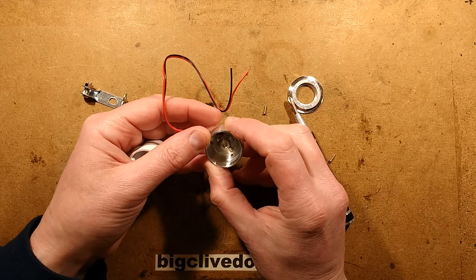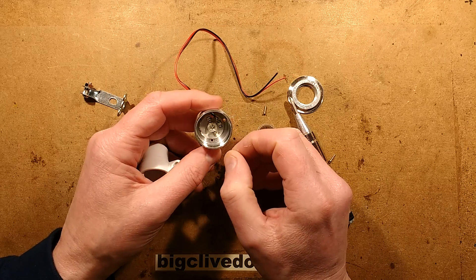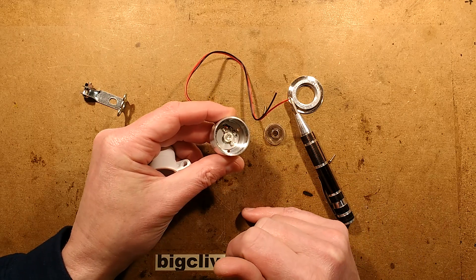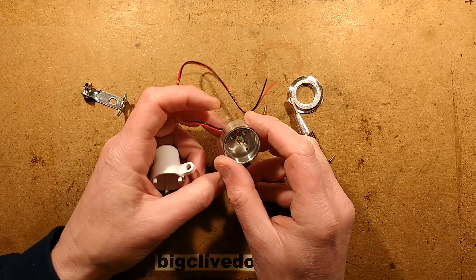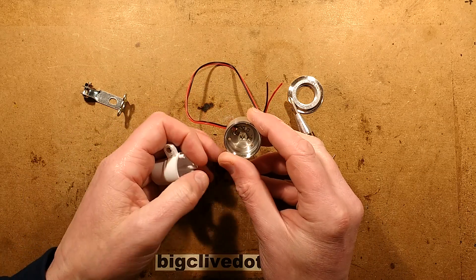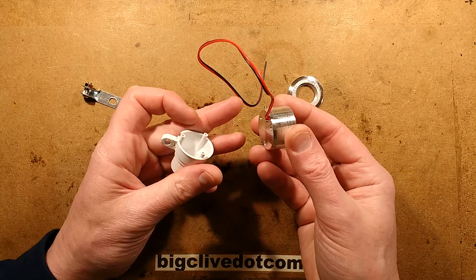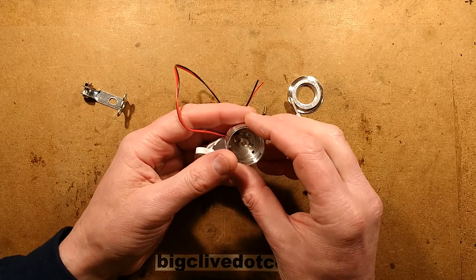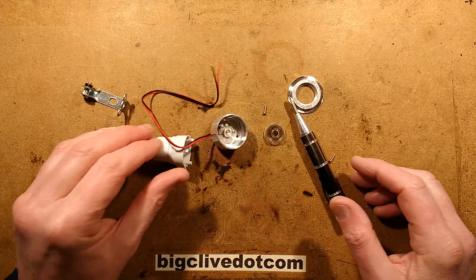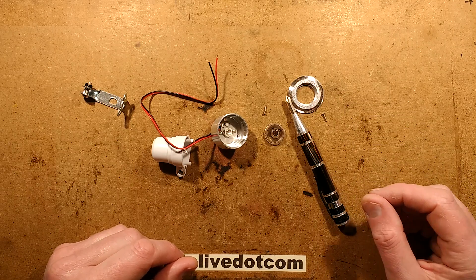It's not exactly going to fail, is it? It does offer the possibility you could bridge over that resistor or bridge it out and add an external resistor, probably by soldering the leads directly onto the LED leads. That would let you use your own regulated supply, or run multiple of them in series with one resistor, or just adapt the resistor for low voltage use. Particularly the white ones could be repurposed as a little downlight. So another of these little generic eBay modules that are ripe for modification.